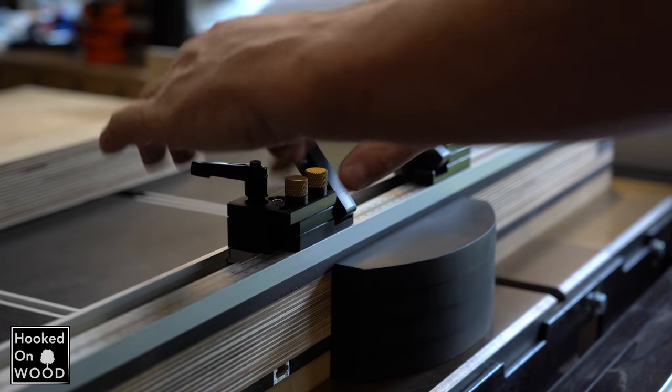The last thing I want to mention are these screws with handle nuts. If you are going to use these miter tracks and T-tracks, I would also get a few of these because they become very handy when you want to make something yourself. I would also advise a set of the sliders with them. I made a fence for my drill press with these screws, and I used the side to slide the fence back and forth. When I tighten the handle nut, my fence will always be aligned at the exact distance from the drill bit, making work with a scale very accurate and repeatable. By holding the fence low, I have no problem drilling a hole close to the edge because the chuck of my drill press will not touch my fence. I really like the fence I made and I think I will fine tune this design, which will probably end up on my drill press platform.